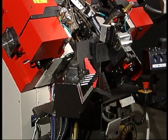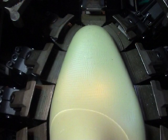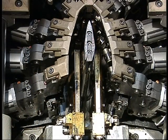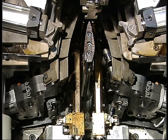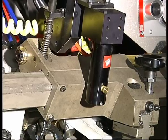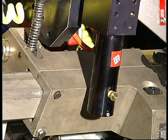Synchron Zero does not cease to amaze. Operators can memorise the profile of the pincers simply by following the profile of the last — it is the only pulling-over and lasting machine that can do this. The last two pincers, located at the waist, each swivel in turn and stretch the leather towards the inside of the last; this movement can be preset and helps to last the insole connection effectively. An optical compass projects luminous lines onto the toe of the shoe, making it easier to centre the upper.